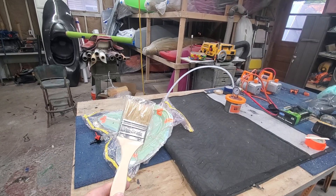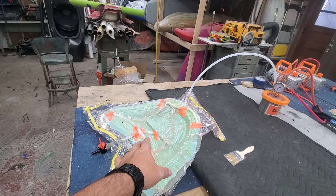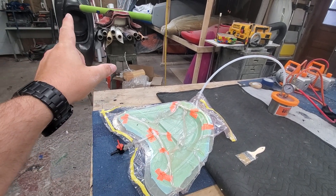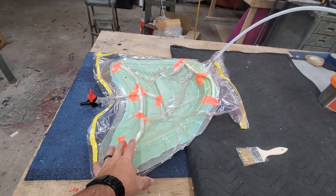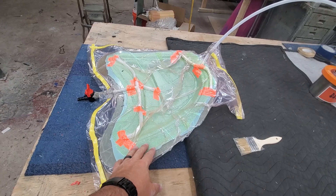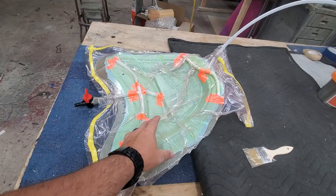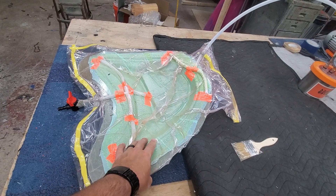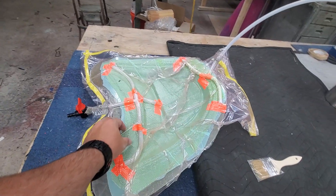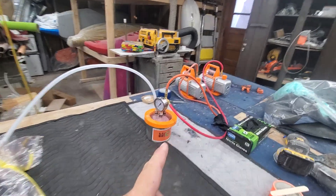Most people think when we lay up carbon we're going to be doing a lot of work with a brush — absolutely not. This is the mold, all laid up for the over-thruster that was on the boat. Everything in here is completely dry. There are two layers of fabric, the blue is a silicone release film, and the green is a mesh — basically like screen door mesh but bigger — which ensures air can flow through.